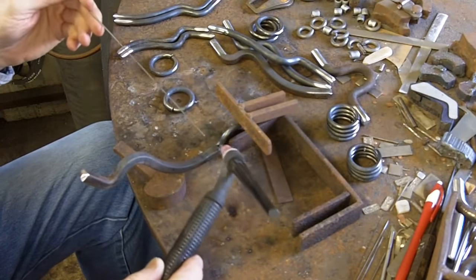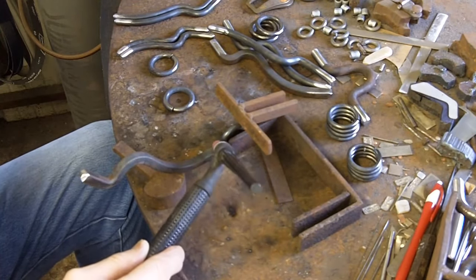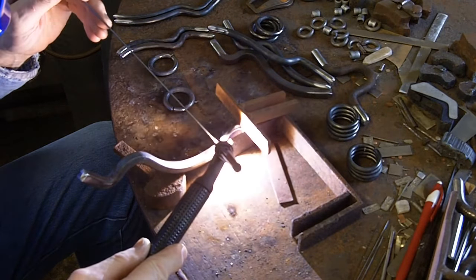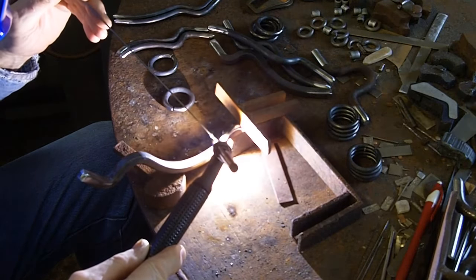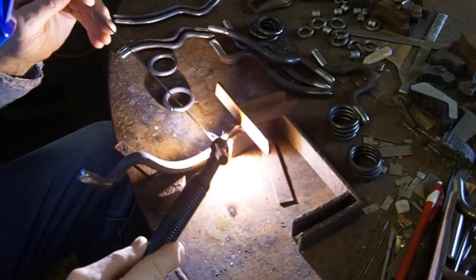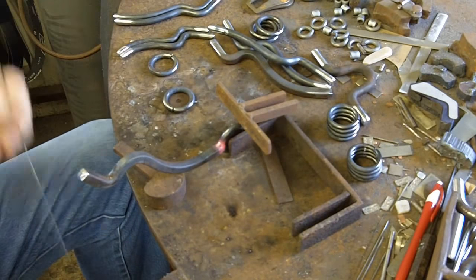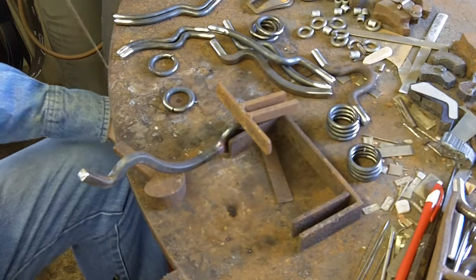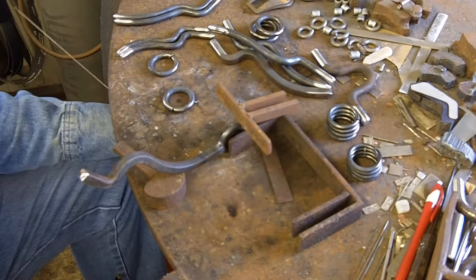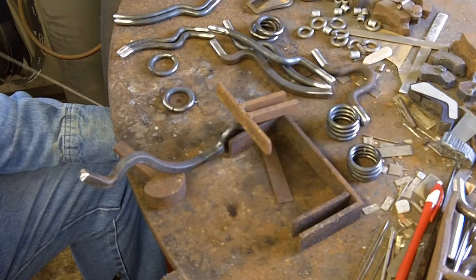Now I've got the shank propped up here sideways. I've got just a little gap there that I need to connect one weld to the other — that's what I'm doing right now. That's pretty smooth right there; I don't have to do much dressing down on that. It's kind of a work bit anyway. You can take J-Flex belts and smooth the weld out and actually blend the weld where you can't even see the bead itself.